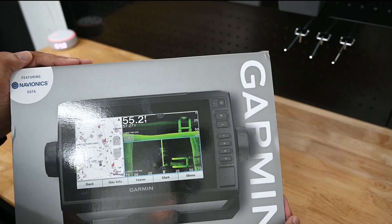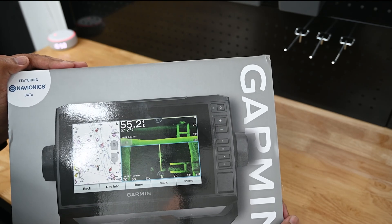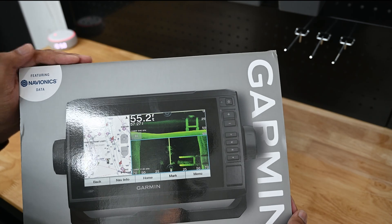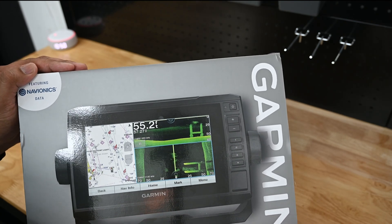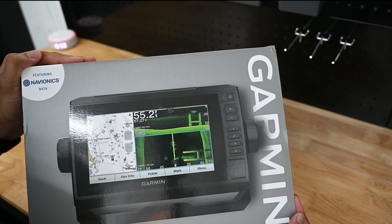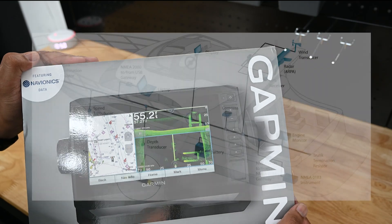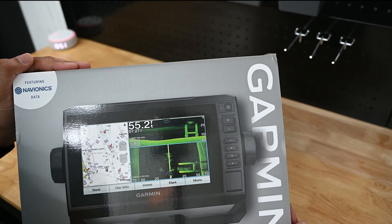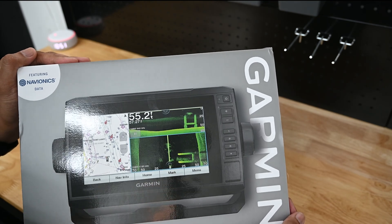Finally, one of the big reasons I chose this — I didn't realize it until I researched the unit — there's a standard out there called NMEA 2000. What that is, it's a standard where all sensors and different equipment from different manufacturers share a common protocol. Different marine electrical equipment all share this standard so they can interconnect. What that means for us as consumers is different sensors can connect to this Garmin — engine data, GPS data from other units, motor controllers, you name it. They kind of look like the mil-spec cannon plugs we had in the Navy, just a smaller version.